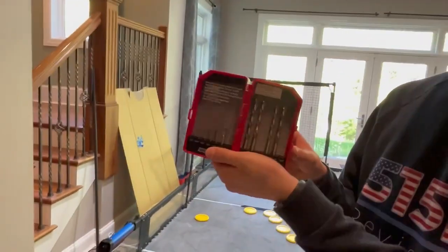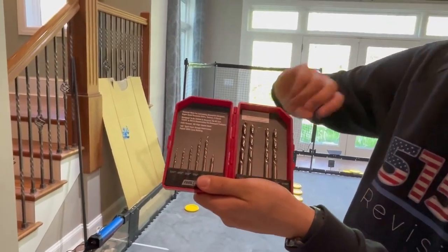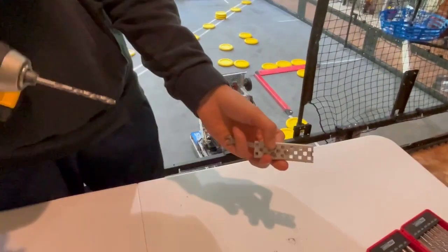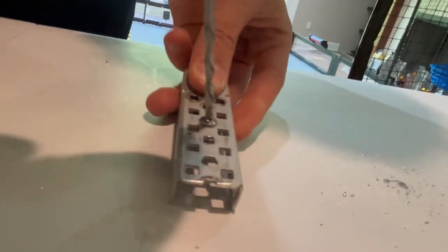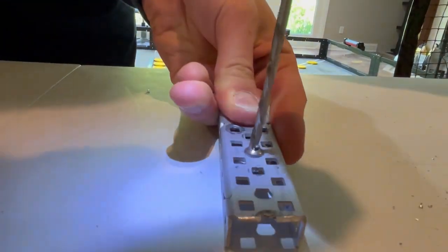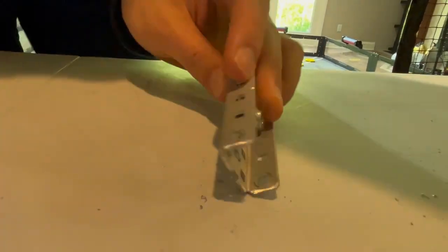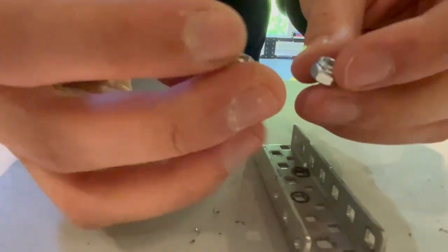Finally, left-hand drill bits are super useful. They're like normal drill bits except the flutes are backwards — the little spirals. What this allows you to do is if you put your drill on to loosen something, say we have this stripped screw — not only when I turn this will it start to drill it out and engage, but also since we're going backwards, it can unscrew itself. Now that screw we were just able to save — it was totally stripped.